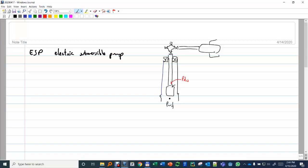Inside the tubing, pressure at the discharge of the pump. If we plot the available pressure at the suction of the pump versus the rate — the pump is usually using liquid, or it might have oil with some gas, but it's mainly liquid. The first pressure we plot is the PWF, which we have seen before. It might be the IPR pressure. We should make it a straight line. Our reservoir is an undersaturated oil reservoir and has that behavior — the IPR.